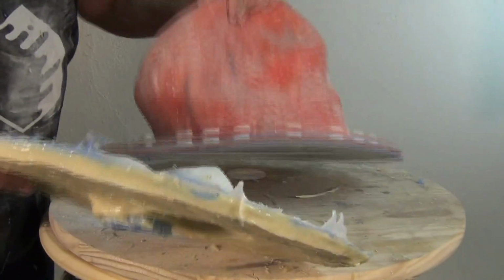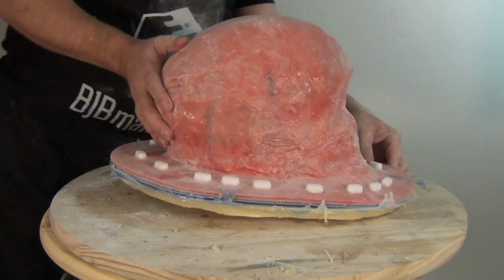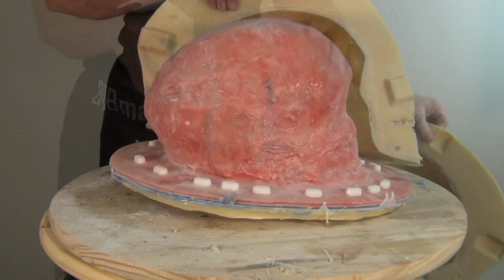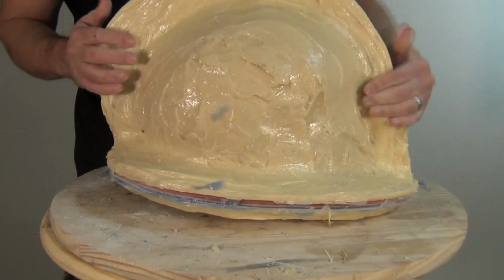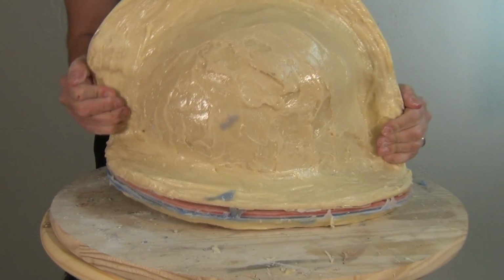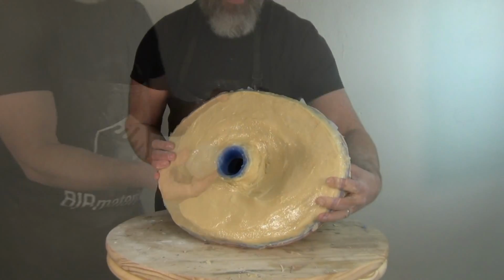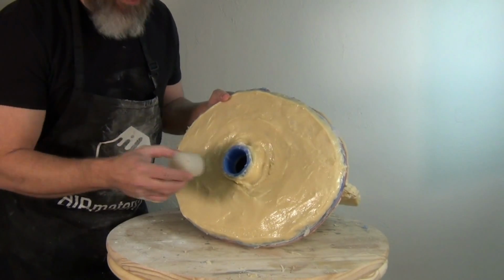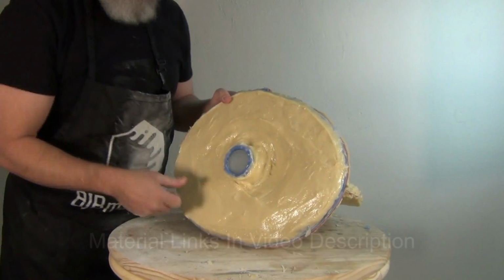So now we can reassemble this whole thing. See, I still have a little bit of trimming to do there on the base, but you see how everything fits together. We got that nice little silicone cap for the bottom, the left and right halves of the mold, and now ready to strap that together or bolt it together and put that on a machine and start casting. And of course we fill in that little port using a plug made with 5110 platinum silicone.